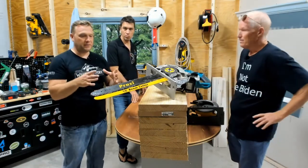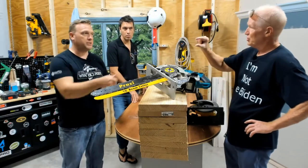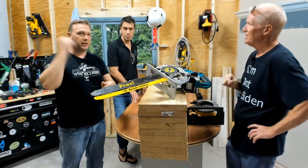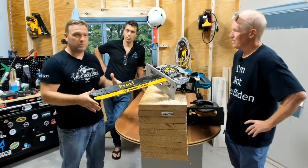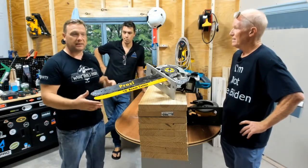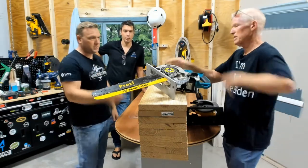For instance, if you're cutting even a 6x6 fence post with just a regular circular saw, you've got to cut that four times — you can only go down two and a half inches and then you've got that little nubby in the middle you've got to break off with a hammer. And when you have to cut through post and beam construction, or any kind of framing where you're cutting through I-beams, where you need that full dimension — you want accuracy — that's what this does.